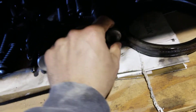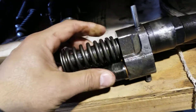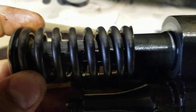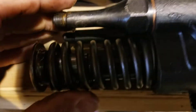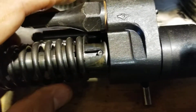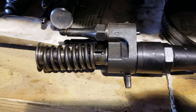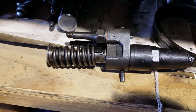Didn't notice anything at first, but this one here — everything seemed to run fine, but after I popped it loose and went to pull it out, I noticed the top pulled completely off. There's a little pin in here that retains this, and there's a slot on this side where that pin is supposed to be. You can see that little piece broken off right there. So originally I was looking for a place to maybe have these rebuilt, but I've already found a set of rebuilt injectors, so I think I'm just going to go that route.